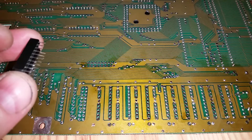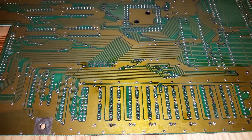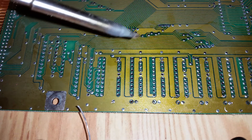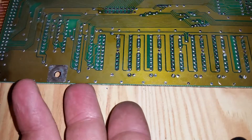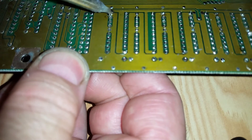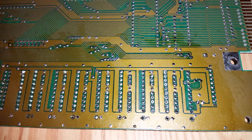I've dropped a socket into each one just to make sure the holes are completely clear - and they are. I'll turn the board over and solder the sockets in. I place the sockets in and bend over the two corner pins, put a bit of solder on those corners, put my finger underneath and reflow the solder just to make sure the socket is flush to the board, then go around and do the other pins. I'll come back for the bypass capacitors if needed.